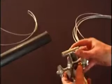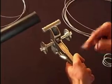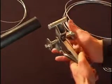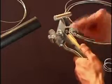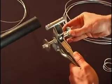Hold the Cortool so that the head faces upward, exposing the cogwheel inside. When held correctly, the shaft with rotary discs on either side appears horizontal. Turn the disc's specially cut notch so that it appears level with the handle.